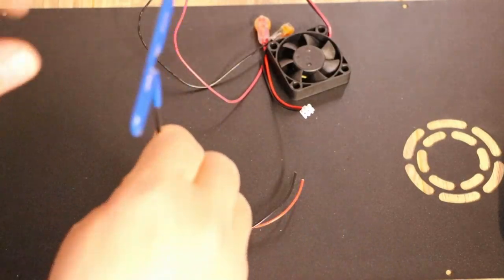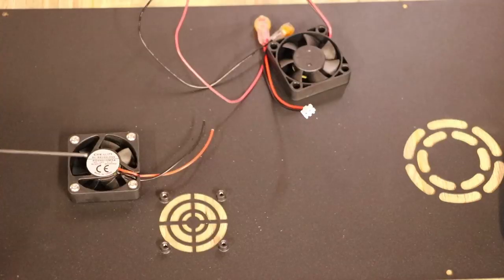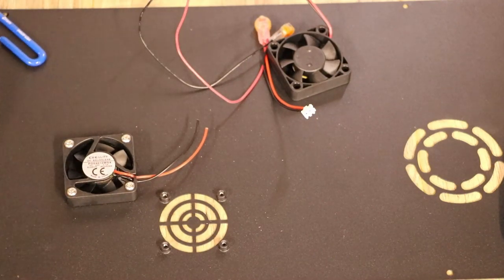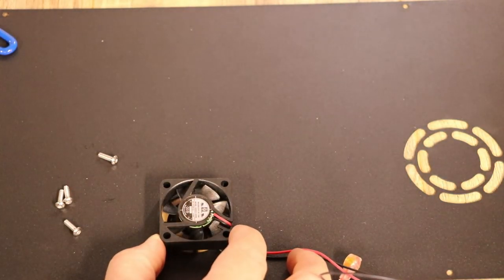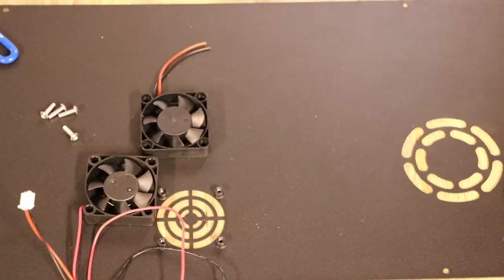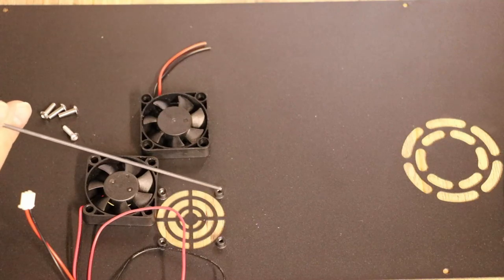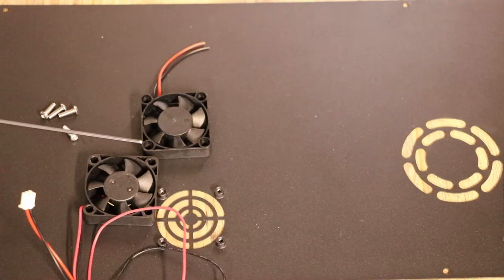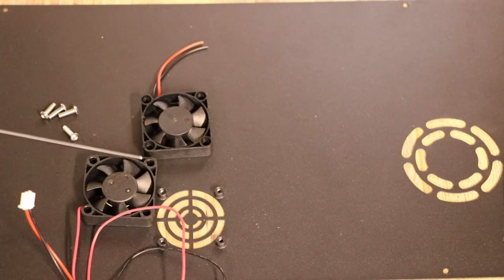Now we want to take the old fan off, so take your Allen wrench and just loosen all the bolts and take all of these out. Now we can see we have the fan out — you need to pay attention that the sticker is facing up. Take the screws and dump them out, and you'll have four screws. The new fan will set like this, sticker facing up. We're going to take our screws and just tighten it in. I realized something: the Creality case has these little round areas here, and the Creality fan is cut out to go around those, but the TH3D fan is not cut out to do that.